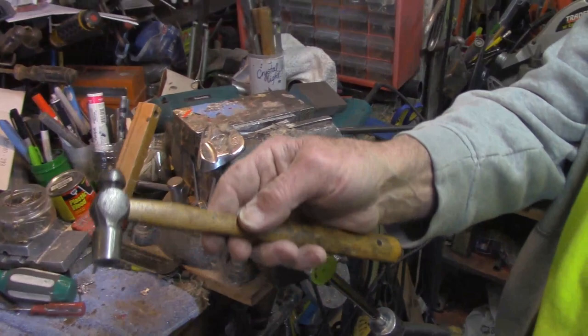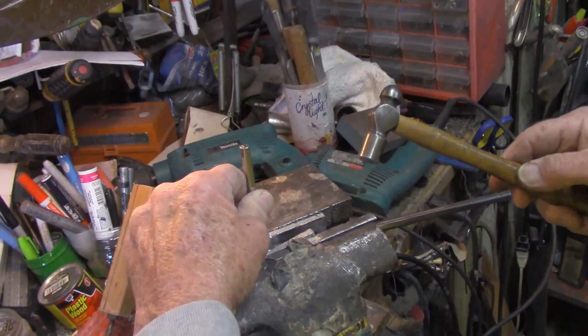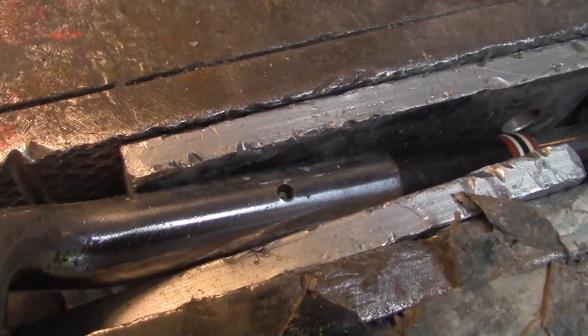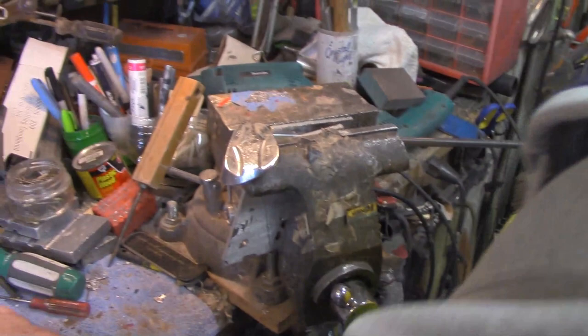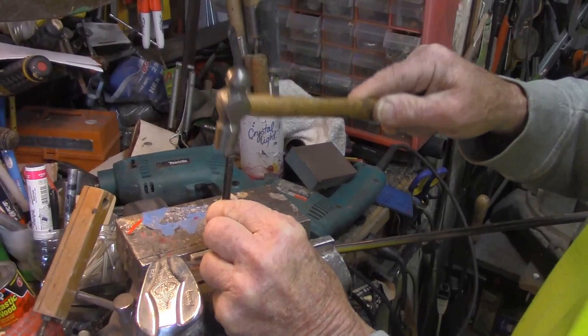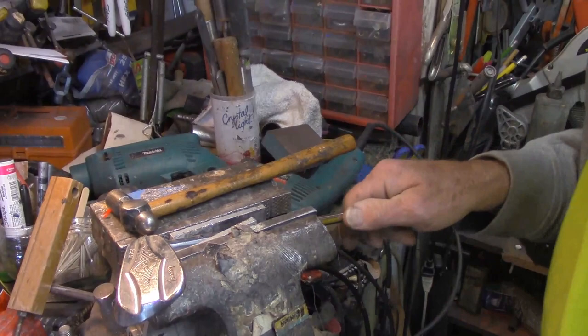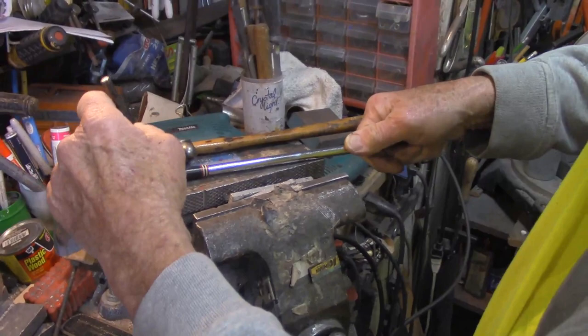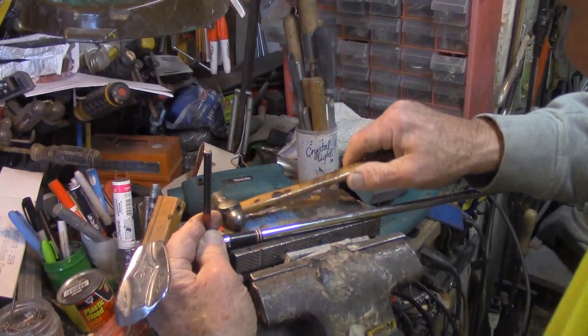I don't need a super huge hammer — I use these small pinning hammers. I very carefully set the pin punch over the pin and tap it. This one came out pretty easily — it has less rebound and it's a good way to start it. Now I take the longer punch with very light taps. I'm not tapping hard at all. I don't try to save the pins — I use aluminum pins to replace them, which you can buy at any welding shop. These are 3/32nds, although you'll find some that are 1/8th.